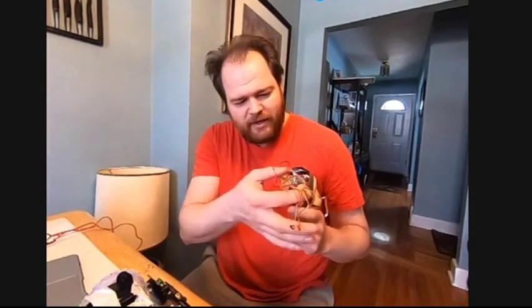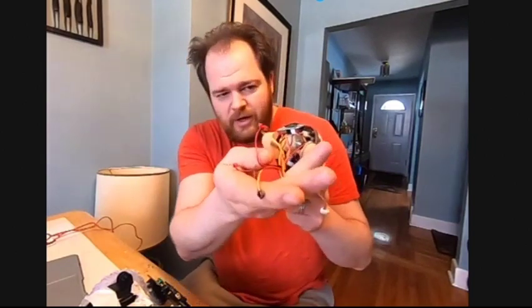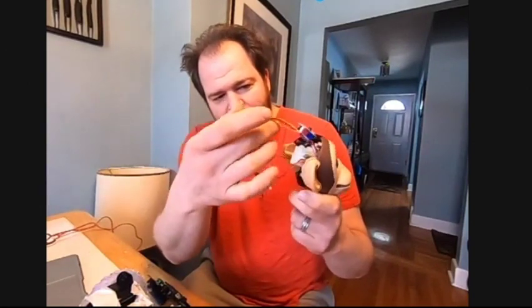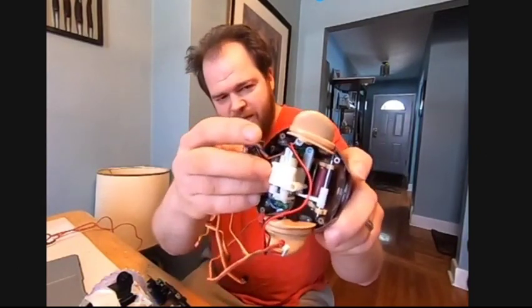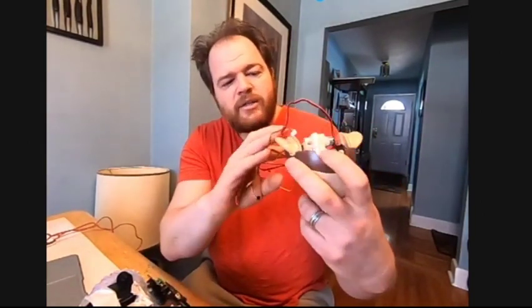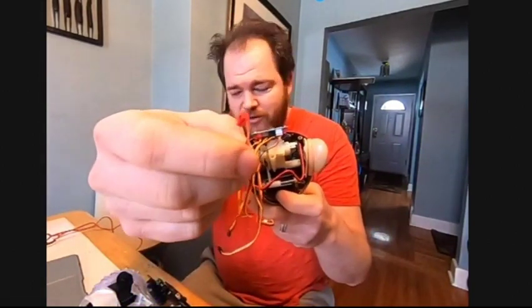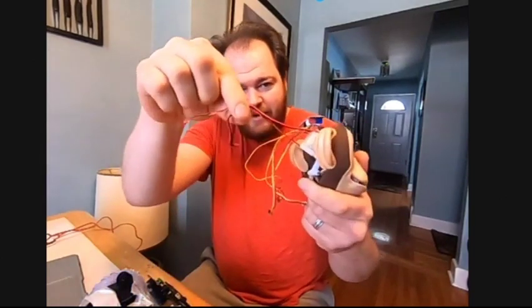This is from a toy that's called a Zoomer toy, and every one of these wires that comes off of it is ready to be attached to a microcontroller. Because they have the pin configuration, everything in here is waiting to be controlled, including this motor right here. This motor is attached to the mouth, and it has a sensor right here. So that's the sensor for the motor, so the motor knows its own position. And so between these two things, I have an animatronic mouth.